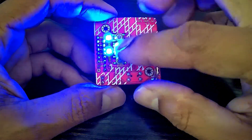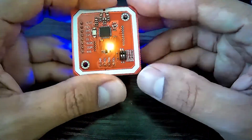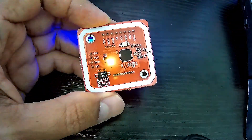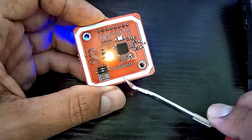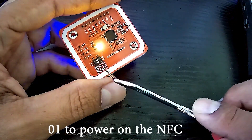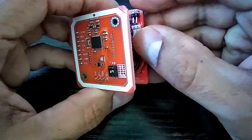If I turn around and look at the SPI connector, I can see I didn't set up the SPI connector, which is what it uses to detect the PN532. I need to put pin one down and pin two up, which means zero-one for the SPI configuration. I'm going to disconnect and connect again.